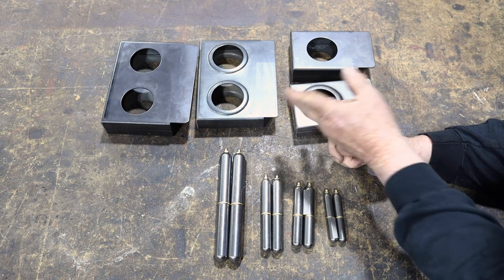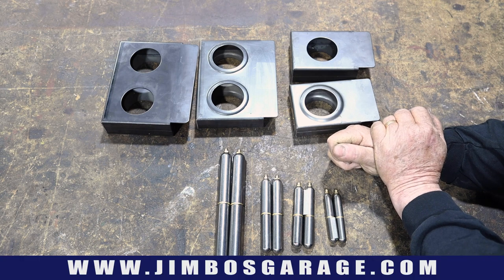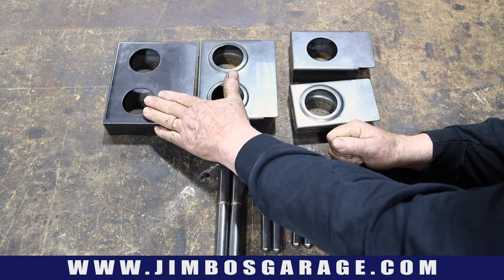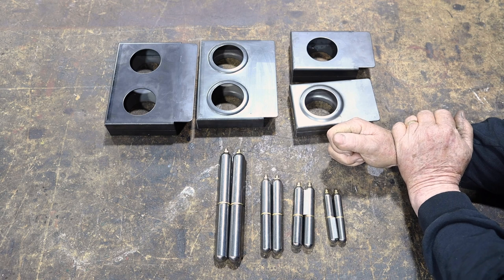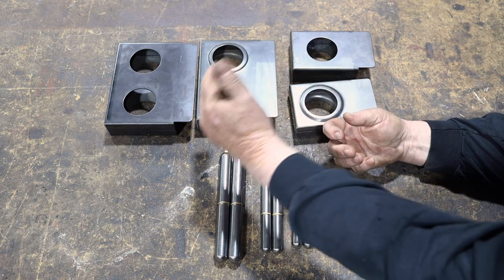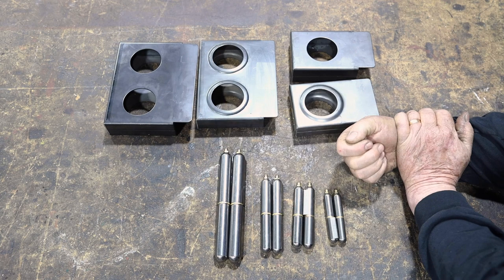Talking about installation for these lock boxes — they have to be built along with the gate frame. When you're making your frame, the side that the lock is going to be on needs to have the lock box incorporated into it. You're going to build this lock box in as part of the frame. The reason is you don't want it to flex. I've done it the hard way — made the frame first, then cut the opening out and tried to put the box in — and it just doesn't work that way. The best way is to build your frame and build the lock box in with the frame.